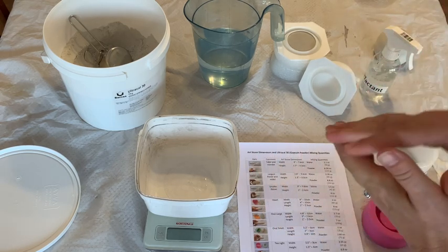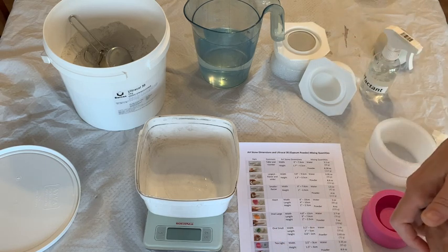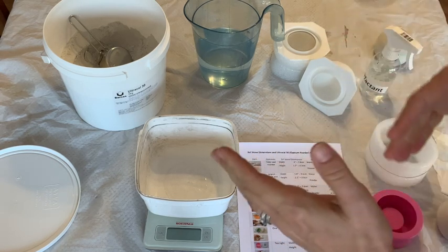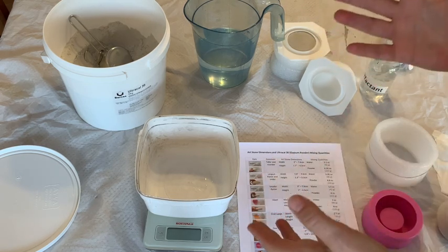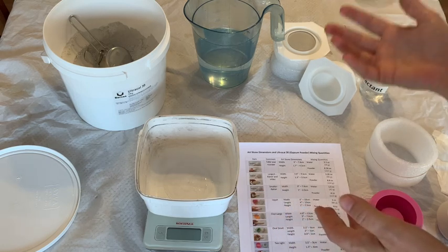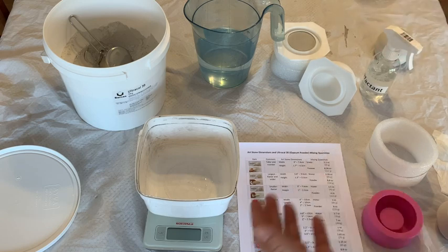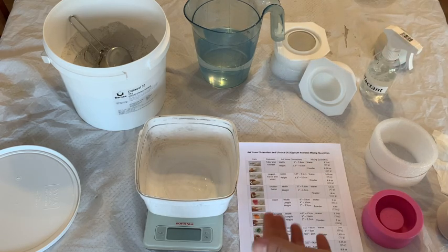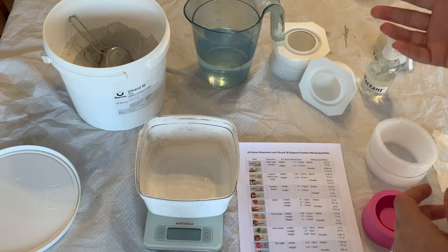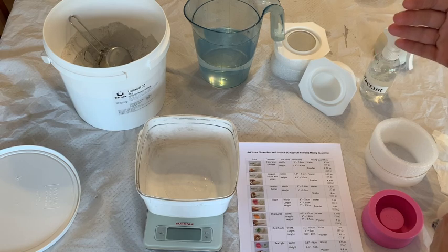There's lots of other casting mixtures available, often in your hardware store, that have different combinations of additives. And there's a product called casting powder in Australia that's very cheap from Bunnings, and it comes in a big 20 kilo bag. And that approximately has 95% plaster of Paris and just 5% cement. I find the difference quite noticeable.